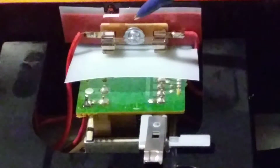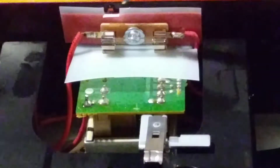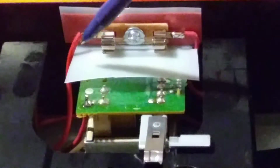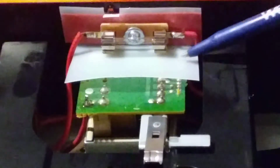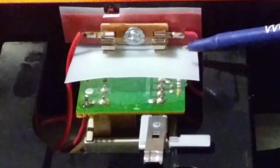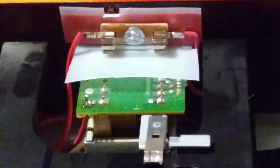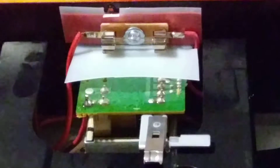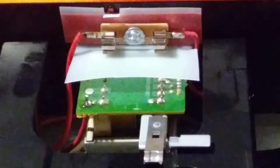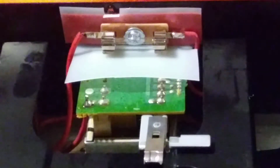Well, here is the line fuse I just put in this Kenwood CD player. And in my first part, you saw me put this piece behind the fuse block. I cut another piece of this plastic to put over top of the transformer here because of the circuit board and the soldering connections here, so that these terminals are very well isolated from the lower voltage. So that's another way to use that plastic that you can buy for separating electrical parts and isolating connections.